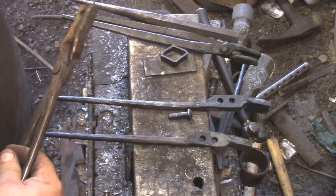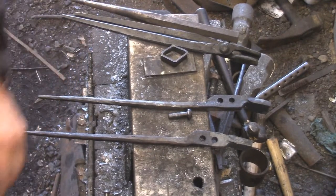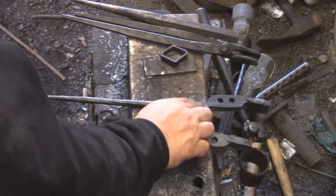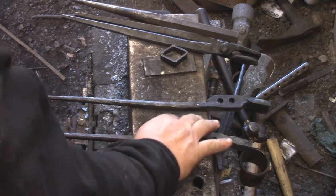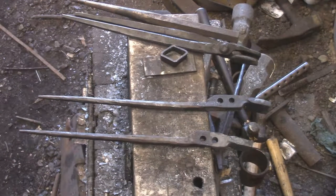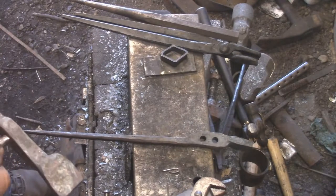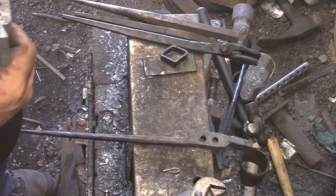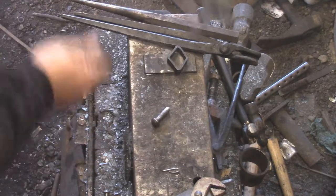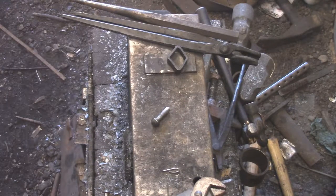Well, that was the first spring clip I made there. I didn't buy it. And I should have annealed it. It's just a piece of music wire. Should have annealed it, bent it to shape, and then hardened and tempered it. Give it a spring steel temper. But I didn't, basically because I knew I could get a better one. Just not right then.